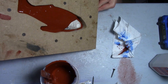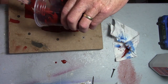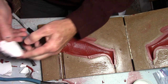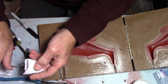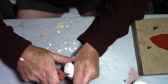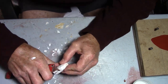I've had parts where I just couldn't quite get them back in — and nothing, I mean nothing on this planet will frustrate you more than getting this far and screwing up the mold. I'll make the insert from this and pour a little polyurethane resin in there. Then I'm basically taking the head of the lure and carving it down about three-sixteenths of an inch all over, so it'll have a good coat of rubber around it.